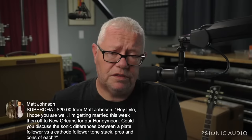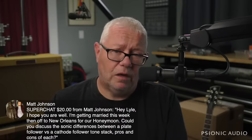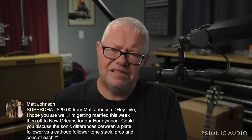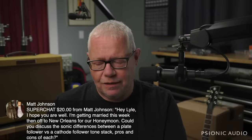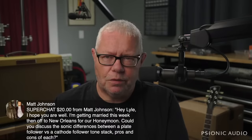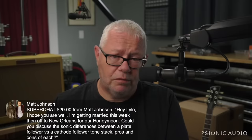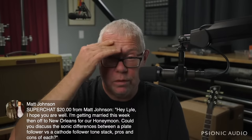If you've been doing this a while, you can tell the difference. A plate-driven tone stack at high gain can be very hard. It can be very splatty. It can get fizzy. Not fizzy in sound, but fizzy in feel. There are ways around that. Like if you have an AC15 Custom Classic where they have the Vox tone stack, but it's plate-driven instead of cathode-driven, you can put a little 500 picofarad cap across the plate resistor for that stage. It takes some of that high-end nails on the blackboard out of it.